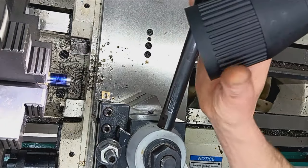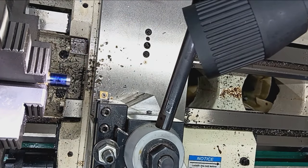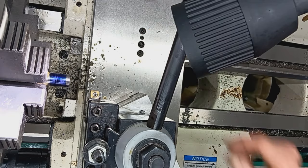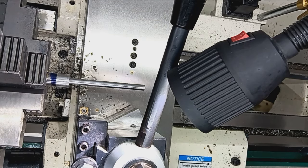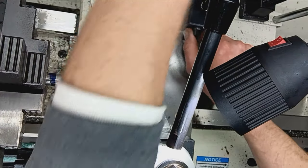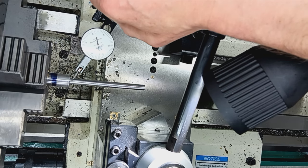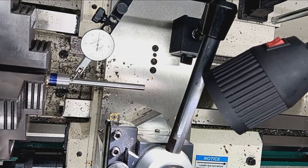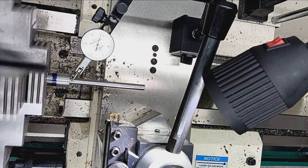I've got the barrel switched around, muzzle end in there. I went ahead and parted off about an inch and faced it. So now I'm going to give the guy a half inch or half-28 thread with a cap. I had it centered and then parted it off — that's a lot of pressure. It's always good practice just to check everything; assume nothing. She shifted a little bit, but we're back centered on the muzzle end here.